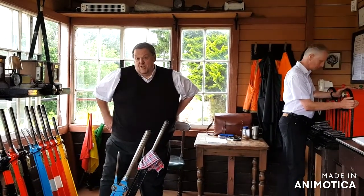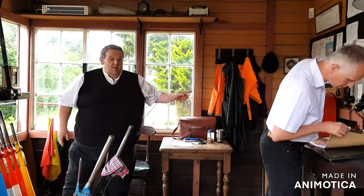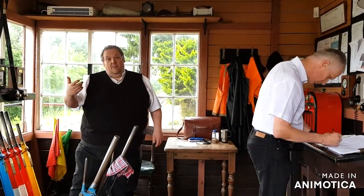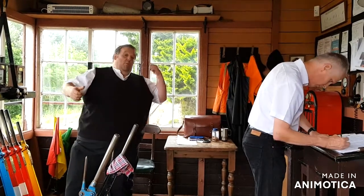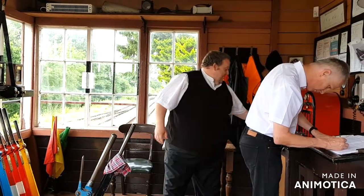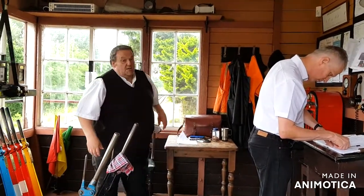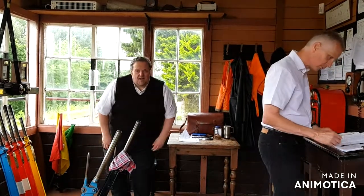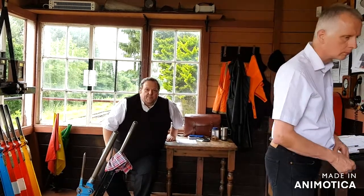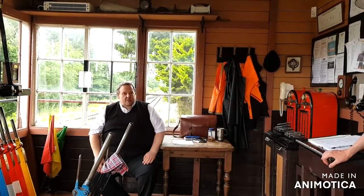So that's Bridge North asking permission to send us a train, and we've just held down. At the Bridge North end, the signaller will just have been able to get a token out. That will be surrendered to us by the fireman when he arrives here, and he will pick up one that we will be able to get out to Highley. That will take him forward to Highley. And if you look, the tokens actually have the two stations they're valid between written on them. So in theory, if you've got the wrong token for whatever reason, you can't put it in and use it in that machine. They are actually keyed on the end so that they won't go in unless they're in the right machine.